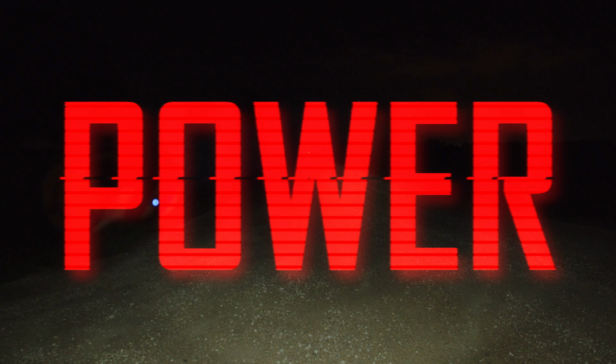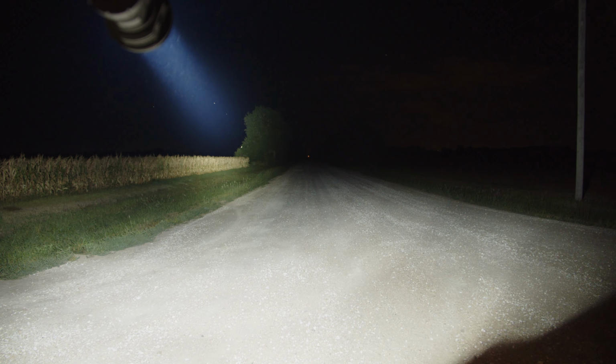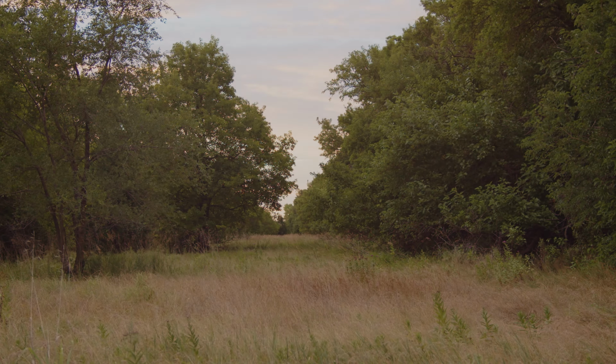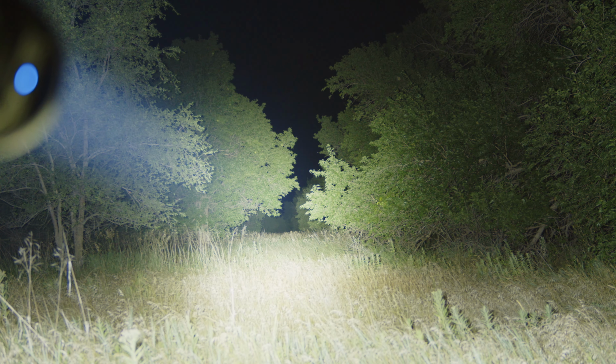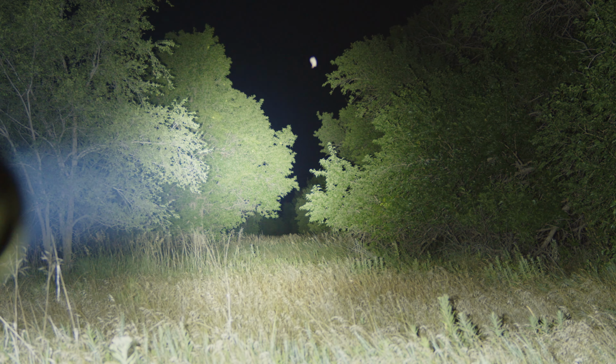The 8 SFT40s receive power from a sophisticated buck driver, which takes the 10 volts from the batteries and drops it to the 3 volts required by these LEDs, a very efficient process that reduces heat and results in great stability. A buck driver capable of this much output is quite expensive and takes more effort to design than the linear drivers we usually see in super bright lights.